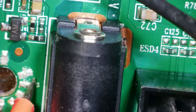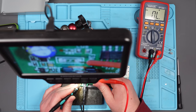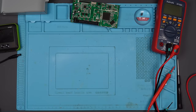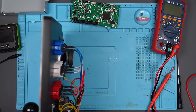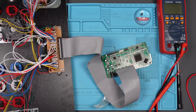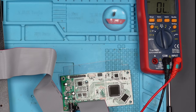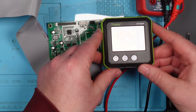And now it's back. Now it's not there. All right, I got it out. Let's leave that on the on position and plug in this cable. It should now think that it's coming on. Obviously we've not got the screen connected — but let's just see if that short is there in this scenario. No. Why not? Do something consistent. Let's get the thermal cam on it and see if that area is getting hot again. Yeah, still getting hot in the same place.